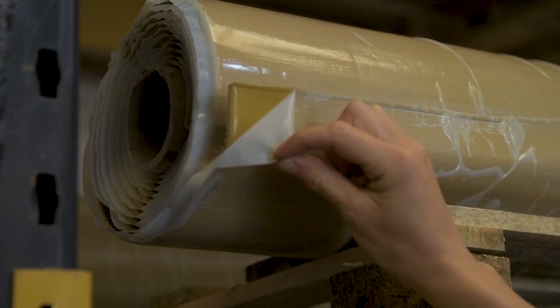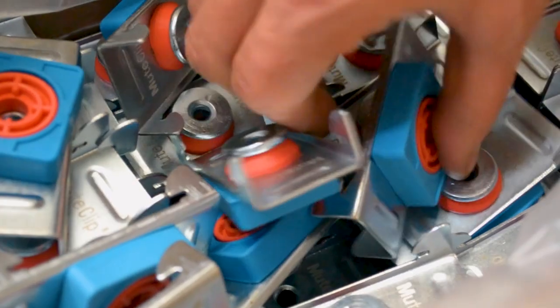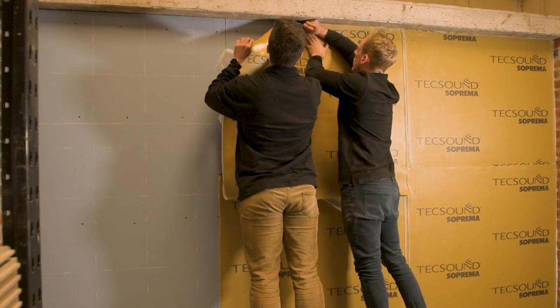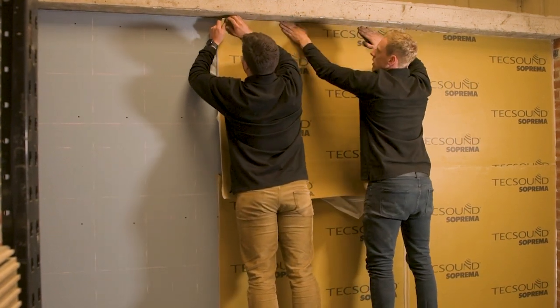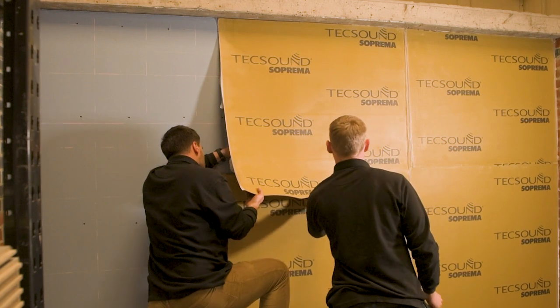For the gold and silver systems we add an additional two layers of mass. The first is a viscoelastic membrane — the gold system uses a different brand of membrane to the silver, which makes the silver system a little cheaper but means the gold system performs slightly better. Both membranes have an adhesive back to aid installation and add a degree of flex, which works similarly to the mute clip shock absorbers by helping to dissipate vibrations inside the material. To install, peel back the film to reveal the adhesive back, start at the top of your wall and roll it down, pushing air bubbles to the edges for a smooth finish.